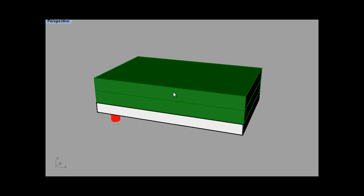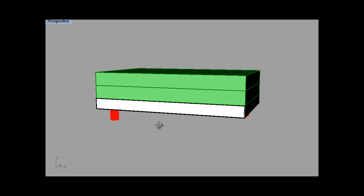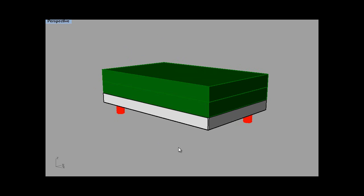Okay, so that way when you turn it over we know exactly where this line is, because it'll ignore anything and cut down, but if it's skew width, when you turn it over it won't see it properly, so it'll throw it out. So you need then to face the top of this and drill your 2 holes as we said before. So write a little program in the tool path to do that. Now once that's done, we're all set up, we can run the program then.